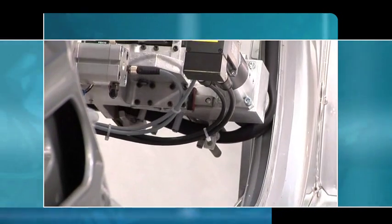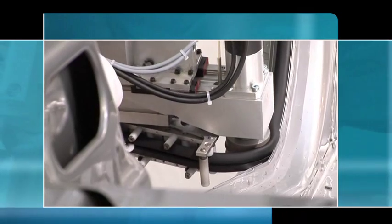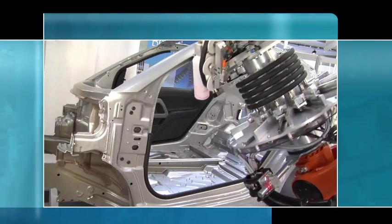This view shows the unit that regulates the application of the taped seal on the body with controlled tension. This fork compensates for minimal fluctuations in tension, which occur as the seal is transported via the caterpillar to the application roller.